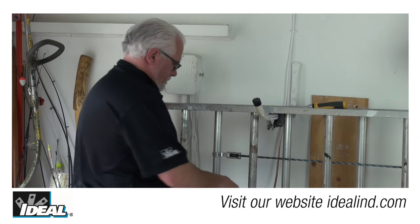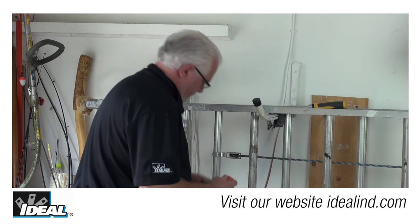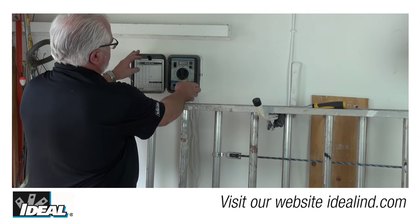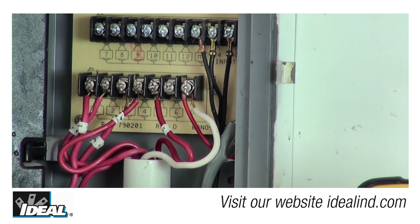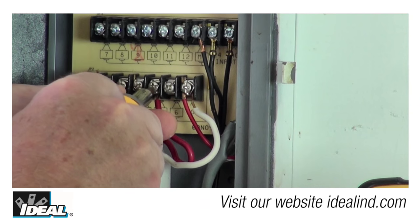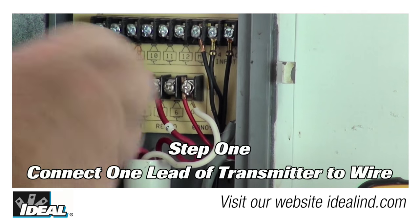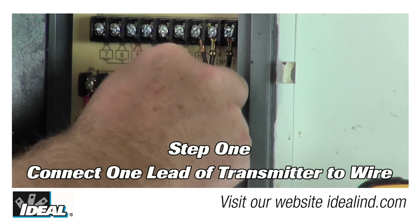To set up for the tracing of the wire, I'm going to first of all disconnect the power by unplugging the valve control panel. I plan on tracing the wires that feed valve number 5 in the system. Keep in mind that all these wires are buried in a trench together and feed the different valves along the way. Step 1 is to connect 1 lead of the transmitter to the hot wire that feeds valve 5.